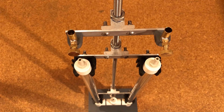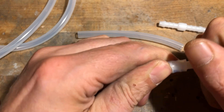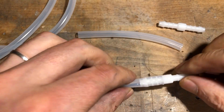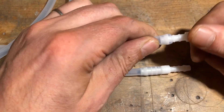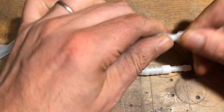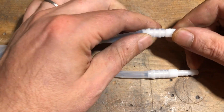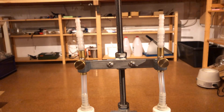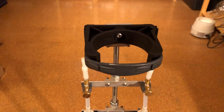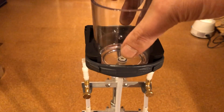After the tubing, the bracket with the pinch cocks was mounted on the threaded rod. Two pieces of silicone tubing 8 x 4 mm, each 100 mm long, were connected at one end with 6 mm plastic tubing connectors. The silicone hoses were then passed through the pinch cocks and connected to the screw and hose nozzles. The acrylic glass beaker was connected to the last remaining screw and hose nozzle using silicone hose with the same outer and inner diameters.